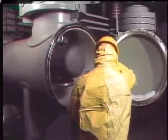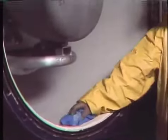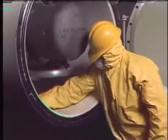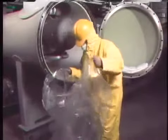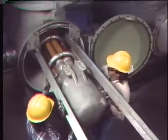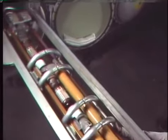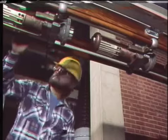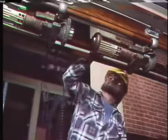After the breaker has been ventilated, the toxic powder should be cleaned out. Besides being toxic, the powder absorbs moisture when exposed to air, which reduces the dielectric strength of SF6 gas and can affect the ability of the breaker to extinguish arcs. All rags and protective clothing are disposed of according to company policy. Then the breaker can be inspected and serviced — these tasks may be more convenient with the mechanisms racked out of the tank. The general inspection, servicing, and adjustment checks are similar to those done for most other breakers; however, contact alignment is checked a little differently for this breaker.